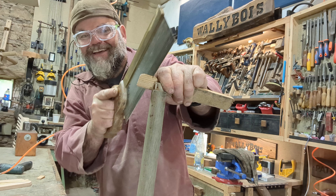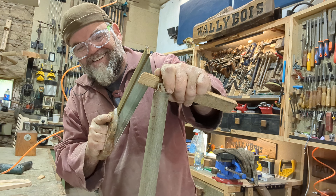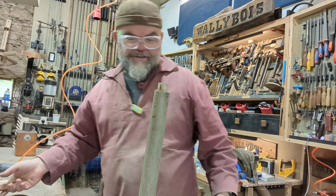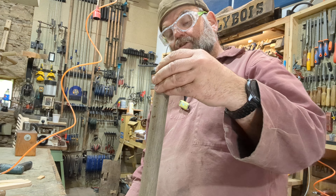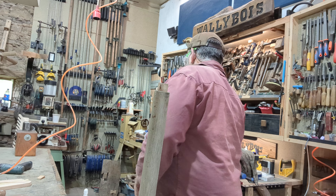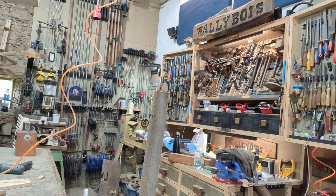Do you like the bench hook? I need that wedge to be no longer than the depth of the actual slot that I've created - it's about there. I am going to use a bit of glue. I'm going to use some PU glue. I'm not using a nozzle because if you use a nozzle it just clogs all up. I'm going to use a stick - if I can find a stick.